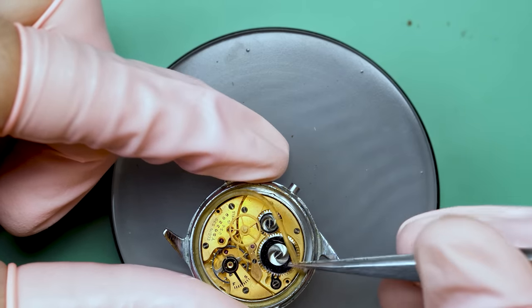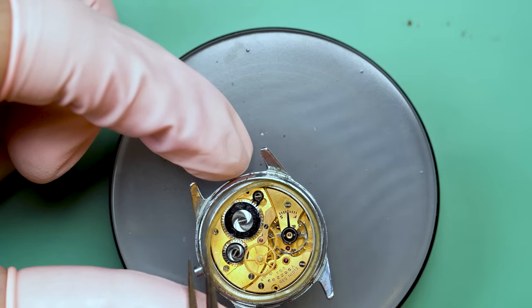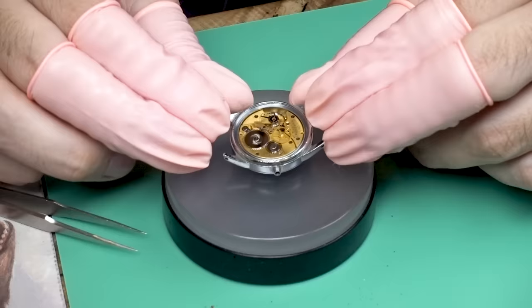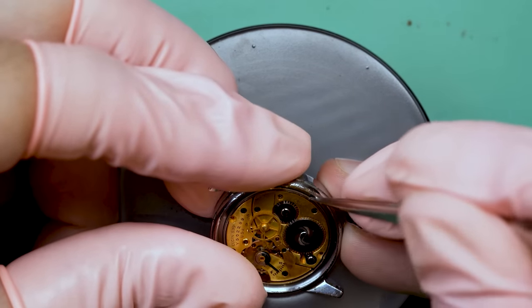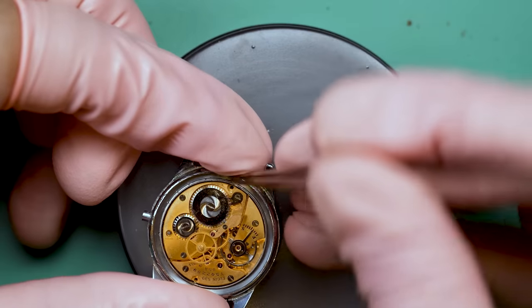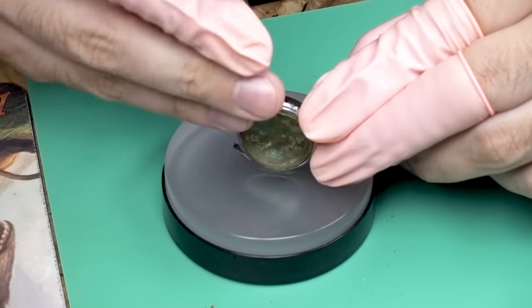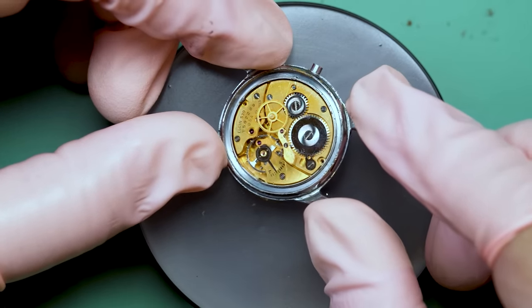There's a little plastic-type protective seal here. I'm really happy to see that the movement looks so good — that's great news. But the fact that I can't even remove the winding stem is not a good thing, especially now that I've broken it off. There's a movement ring that holds the movement in place so it fits perfectly within the case, but it doesn't seem to want to budge either. There's a decent chance it's rusted. Trying to give it a tap to get the movement to move, but nothing's working. It seems to be just rusted solid.